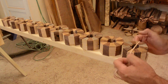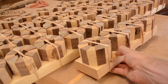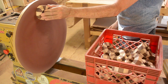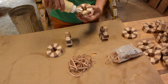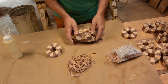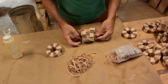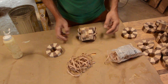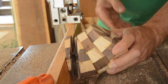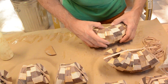I really like using rubber bands because they are very versatile. Once my wedges were cut, I sanded the faces and started gluing them up. Once I had them glued up into groups of three, I realized that they were not quite cut at the right angle, so I trimmed a little bit off on the bandsaw and continued to glue them up.